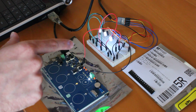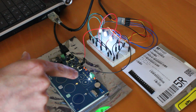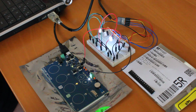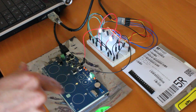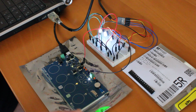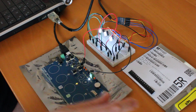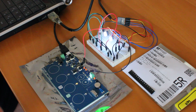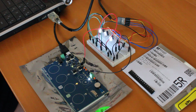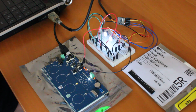So I'm going to be switching this up and rebuilding some code to use the I2C inputs, which give you 256 levels of control, steps, for the motor strength, and you can run through demo modes on this, and it's really a smooth transition. So I'm not worried that 256 will be insufficient. There's a lot of logic in each of these 15 chips here that really allow you to drive this in a way that'll make it feel real. And they're only a year or two old, I think. So this is all kind of new tech that's been coming out that I'm trying to take advantage of.